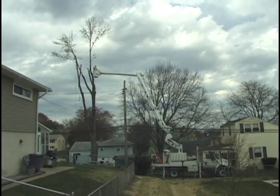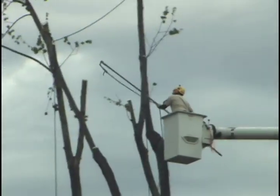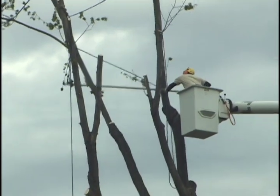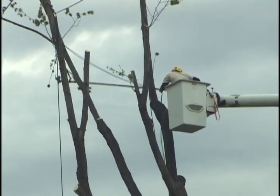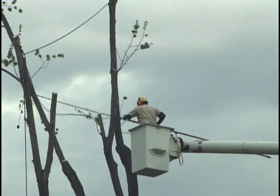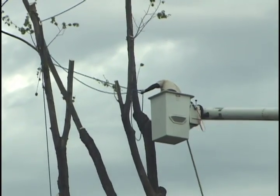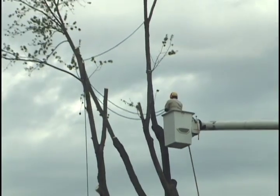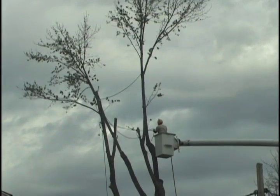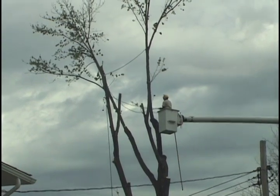Here's a good shot showing all the side reach of that truck. It makes the tree look a lot smaller than it really is because it's such a big truck reaching out — that's six to eight feet beyond the reach of the bucket. There's no way I can set the line out there without the use of the pole. Once that piece is tied out that far, I have no worries about clearance — I know the tips are going to clear the wires.